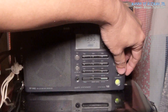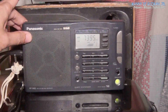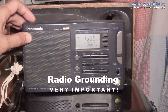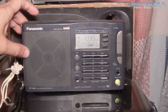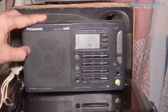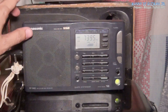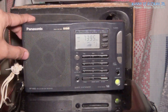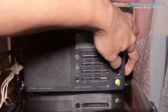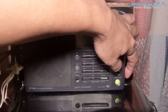So as you can see, this radio cannot be improved by just clipping an external antenna wire - it needs to be grounded as well. With our antenna connector jack, we are able to connect the positive wire of the antenna and provide the ground as well. So I hope you like the video, and let's hear more of the reception.